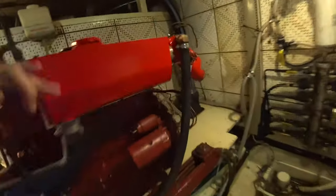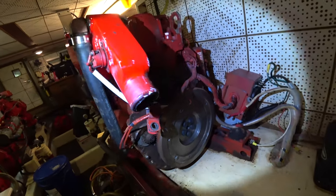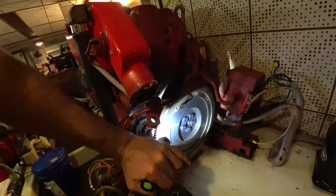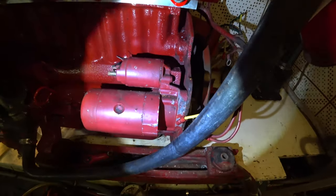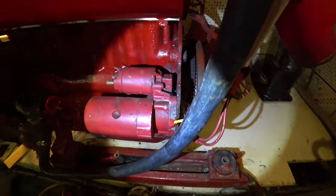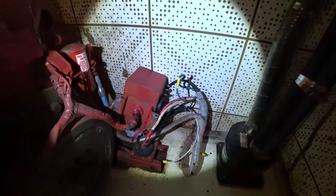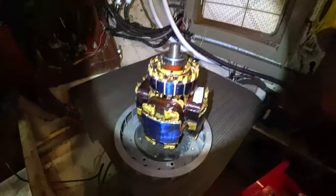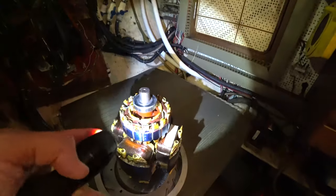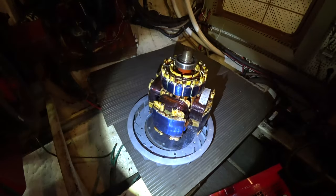So here's the generator. You can see where the stator housing connects up to the engine block—this is what spins the armature. Here's the starter, which I ended up not having to take off, which is a good thing because it's pretty much frozen into place. It still looks like it's in good shape, so I just left it there. There's the control box. And now we have the rebuilt armature—you can see the new bearing. This is what failed: it allowed the armature to go off-axis and chew things up inside the stator housing.